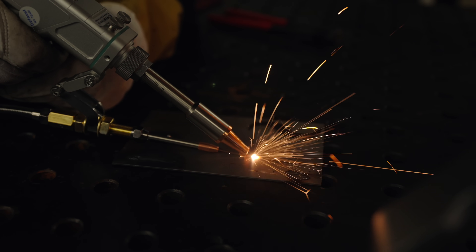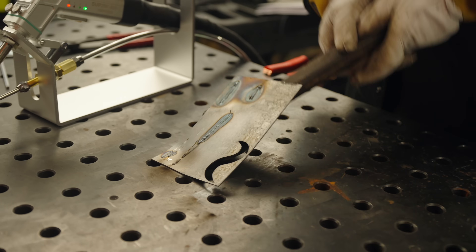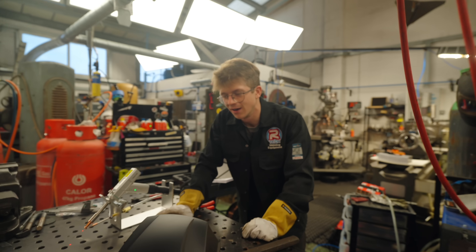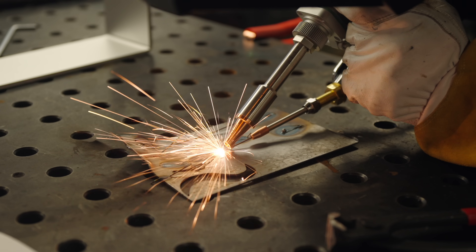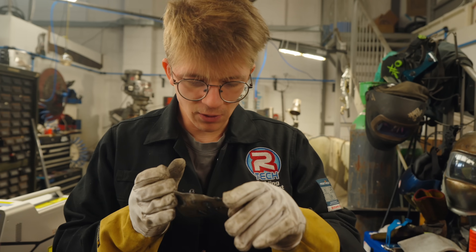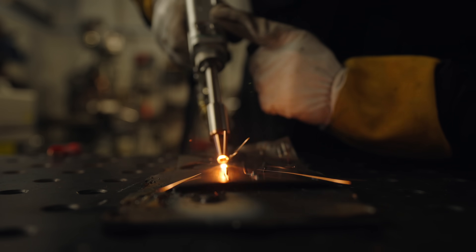Why are you not going? Now you're going. You're joking! It penetrated so much that it stuck it to our 16 millimetre thick honking work table. That's crazy. Let's try some automatic parameters. Now we're talking. That is laser welding, boys and girls! Look at that middle one — she's a beaut. It would be impossible for me to do a TIG weld that looks that pretty. And look at the penetration on the backside. Mate, when that wire feed is good, it just pushes you along. There is no skill required.